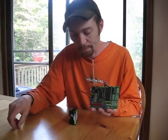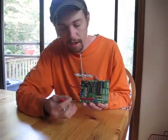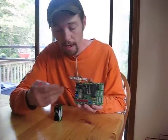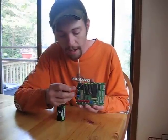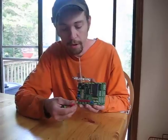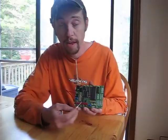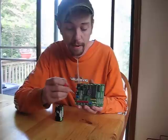Basically what I've got: when the program starts, LED zero output pin is going to blink three times, which tells me to start recording. At that point it's going to cycle through and record 250 moves. As I sweep this trimmer back and forth, I'm going to turn on one of the eight outputs in succession, sweeping these lights back and forth. As I'm doing that, the EEPROM is going to record each of those lights coming on and off.